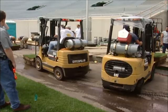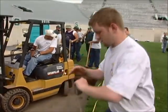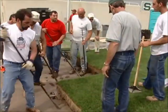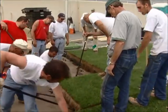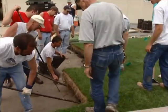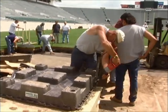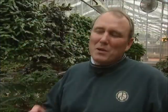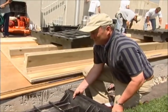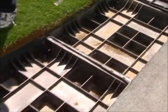When you lay from the outside in, you can't get them tight — you might have a couple of gaps. That's why when we were putting in the last couple of modules, we had to do a little more wedging. As for that last row, you saw people cutting the modules in half with saws because the field wasn't exactly 100 rows — it was 100.75 rows. We missed just a little bit, so we had to trim some of those last modules, about six inches or so.